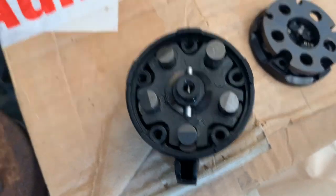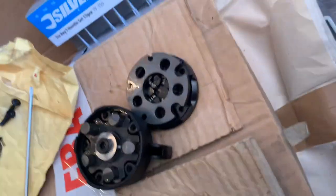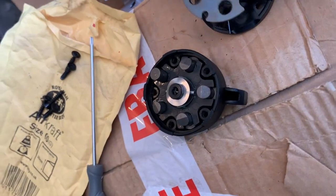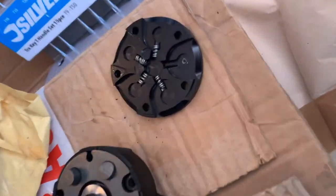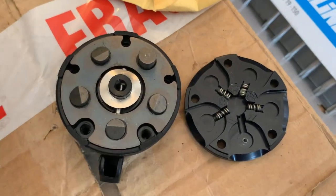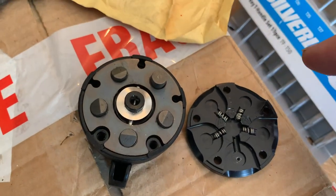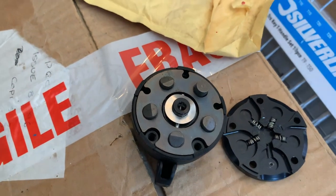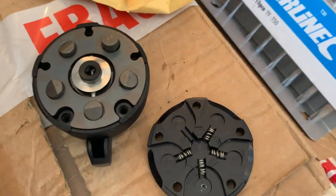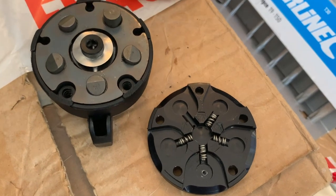There's my locking pin back in place and the washer dropped back on. Next, take that metal plate and drop that back over the pins, and we are nearly ready to reassemble. Because we've moved that pin and that pin around, we need to move that spring to there. The back is obviously a mirror image to the front section, so because I swapped the top right pin, I need to swap the top left spring. I've done that now, and now it's ready to go back together.